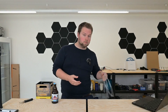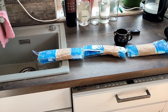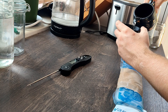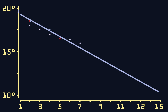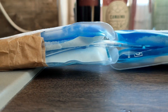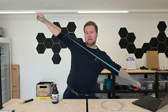The best thing I could come up with was to build a flow cooler using some tubing like this one, and cool packs. For the first test, I used some regular propylene glycol ice packs that were at negative 18 degrees Celsius. I put three of them in series and ran a tube through them. The input water was at about 19.7 degrees Celsius and came out at about 18.4 degrees Celsius — quite the delta. Running the same water through the setup a few more times gave me some nice data for a very crappy regression. Factoring in that the tube was hardly touching the cooling pack at all times and there were quite some gaps, and doing a little bit of math, I figured I would need a tube that was about five and a half meters long. Crap.